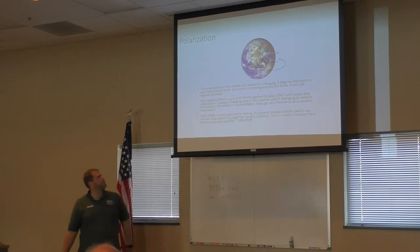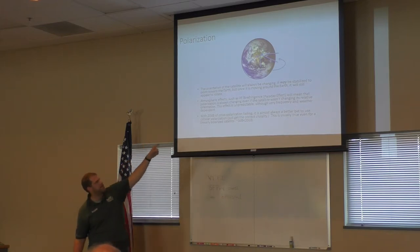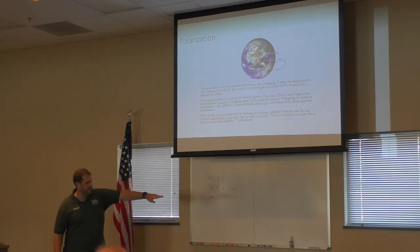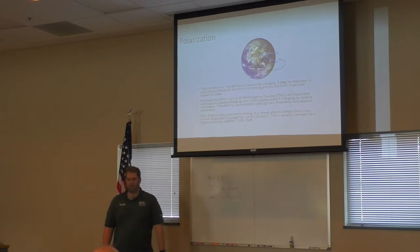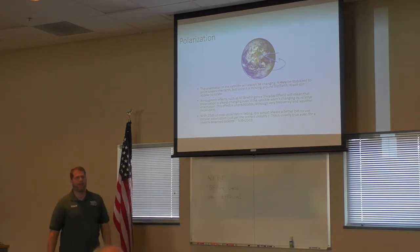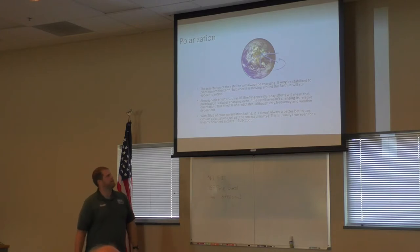With satellites, the polarization's changing just because it's sitting there moving on us. Imagine that the satellite is going along the equator and those arrows are an antenna pointing at us. Well, it seems to be rotating, and that's for a satellite that's fixed on us. Okay, the newer ones are about 4 inches cubed, and you can literally hold them in your hand. I've got a picture of that coming up. And when you have something that small, you generally don't waste the space on keeping things pointed at the Earth, so they're just tumbling. So polarization becomes very important.